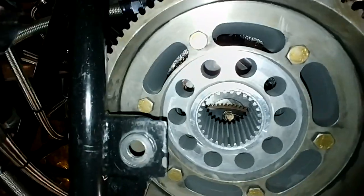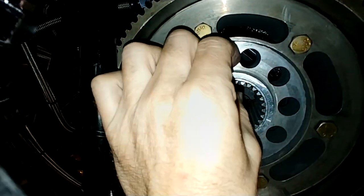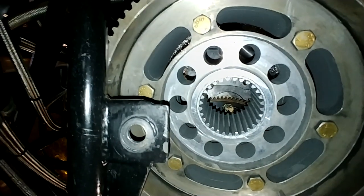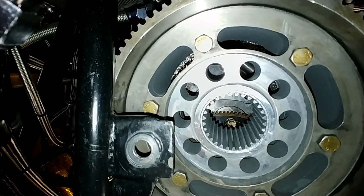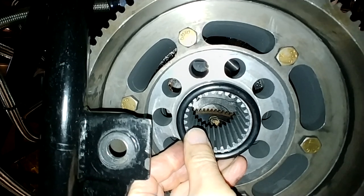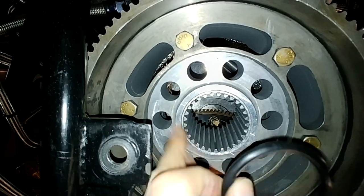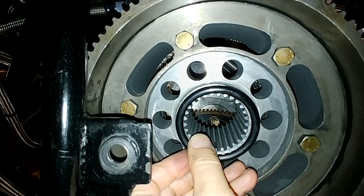So what I'm going to do is have the larger donut spacer here, which is just going to have a diameter around about this, matching the same as this, instead of the little thin diameter. And then I'm going to put an O-ring in there, a big fat O-ring I've already got right here. So that's going to be in between this new spacer and that, and so it's going to act kind of like a spring washer. And then the bolt on the other side, which holds everything tight, I'll be able to crank it down against this and really get that thing to snug up nicely.